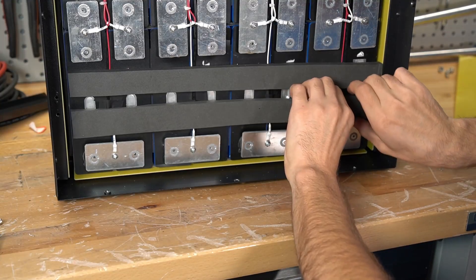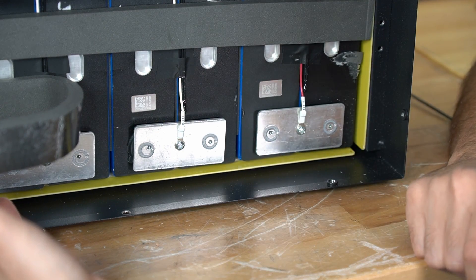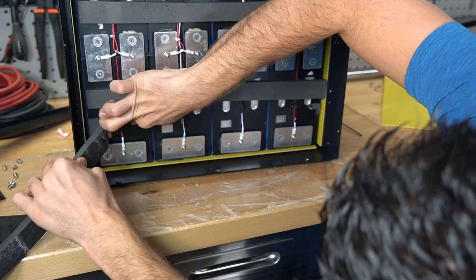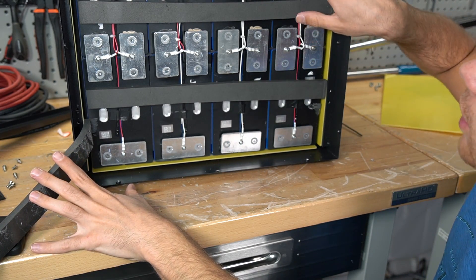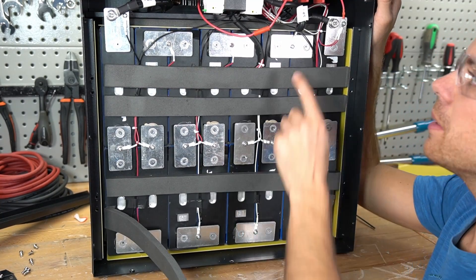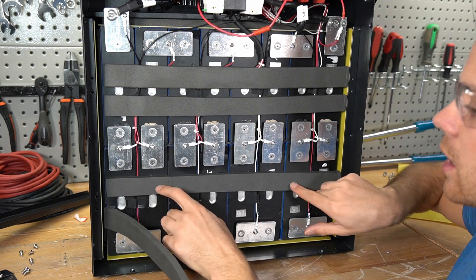The foam is also holding the temperature sensor on the cell, which does work — I've seen very expensive batteries like Battle Born that tape their temp sensor on cells the same way. Personally I prefer a potted terminal connector attached to the bus bar. All of the temperature sensors are on one side of the pack, which isn't ideal. Typically we want one sensor on each side. This BMS does have its own ambient temperature sensor on that same side, so maybe that's by design, but I like to see them spread out.